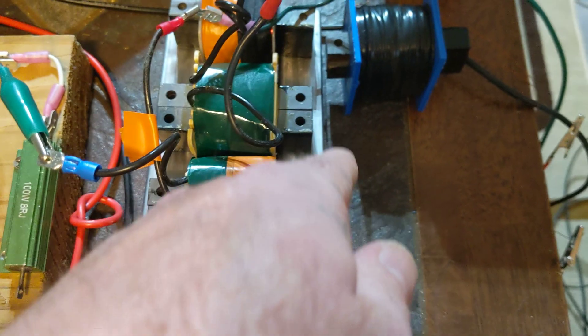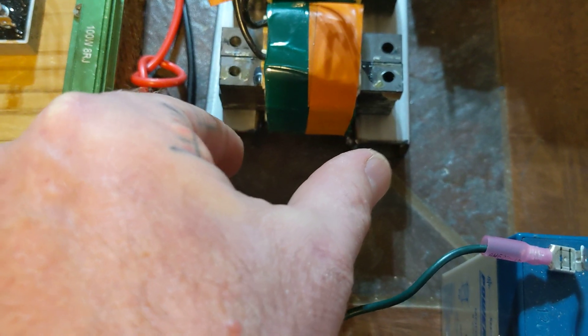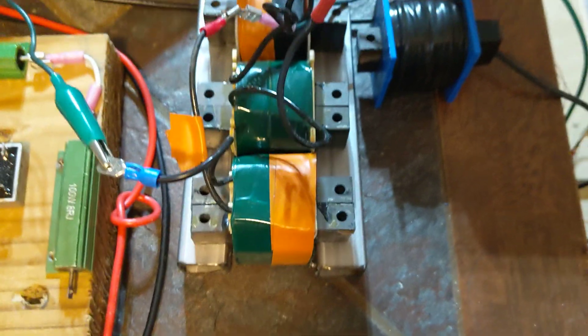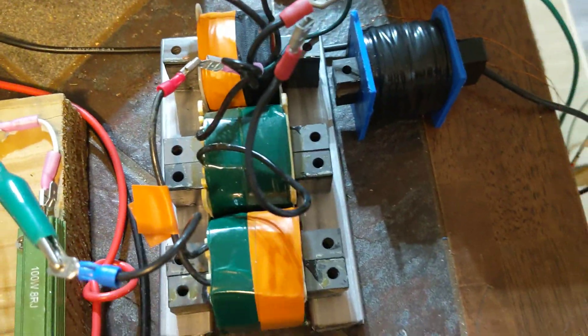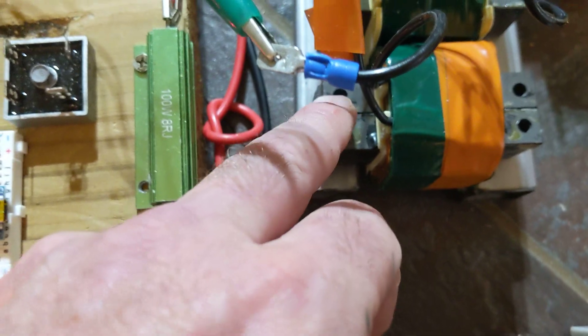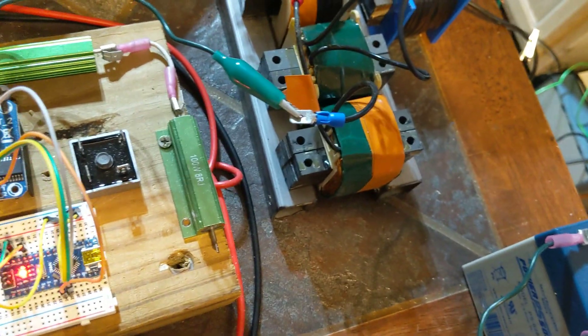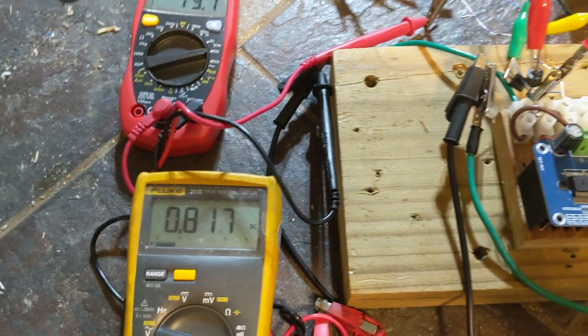All like-poles grow the magnetic field as it pulls power. When I add another pickup coil, I'll get that output and more magnetic field in here, and this output increases — so it's cascadable. I don't have enough laminated iron though — as you see, I'm using hollow steel bars and they're not ideal. My output got a lot better once I put laminated iron in, because eddy currents work against you here. But that's the setup and that's the direction we're going.